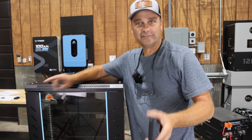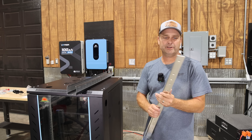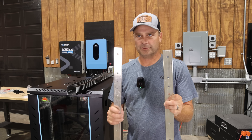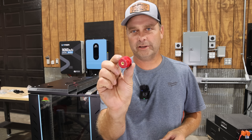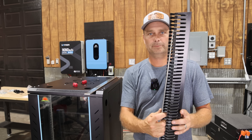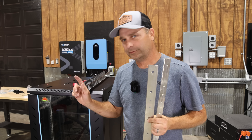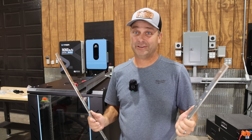This took me longer than I thought — it's already 2:05, so I've been at it for two hours. I've got the entire cabinet assembled except for the bus bars. The server rack cabinet comes with two bus bars and they're fairly heavy. I ground off the corner just to verify and it is copper on the inside but silver on the outside, so they're probably nickel-plated or silver-plated bus bars. They're already pre-drilled and tapped for the bolts. It comes with four insulators to mount the bus bars off the cabinet, and it comes with some Panduit to install the bus bar inside the Panduit so you can make your wire connections and cover everything up to keep it safe. I'm going to go ahead and get the bus bars put together — there's one that mounts on the left side and one on the right side for your positive and negative bus bars.